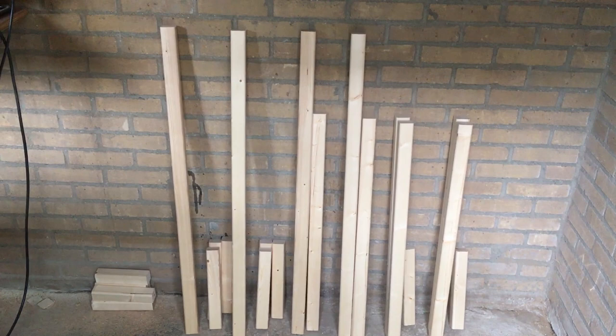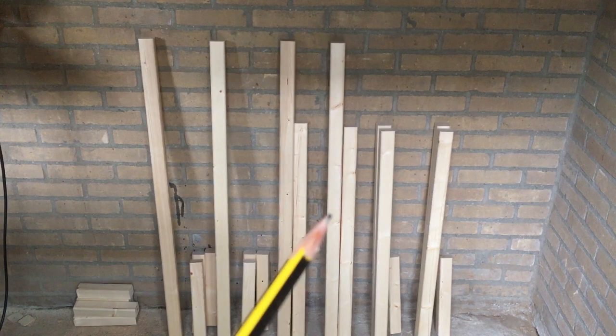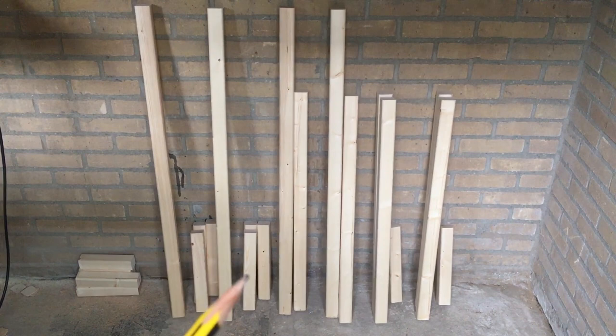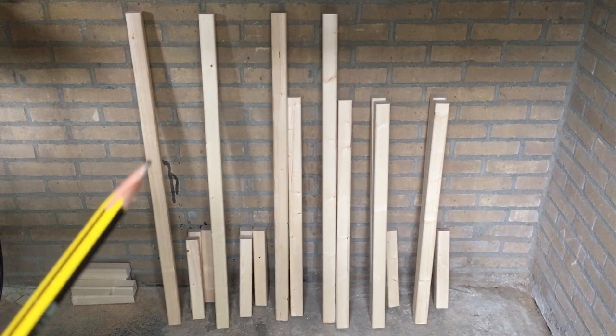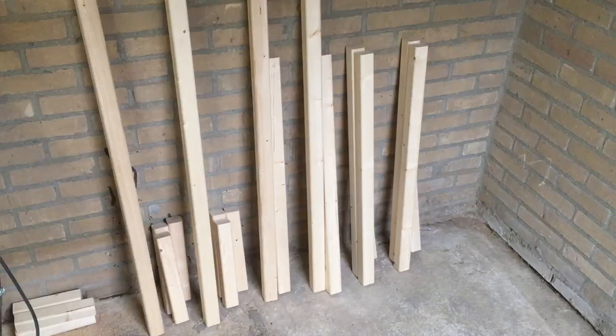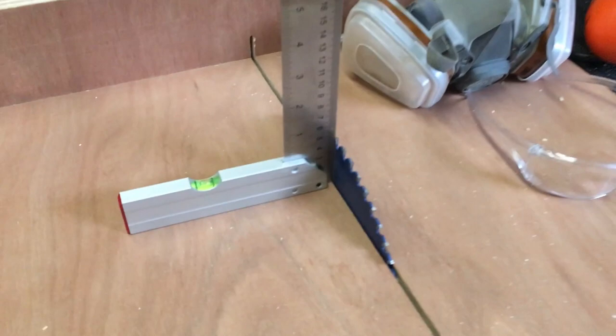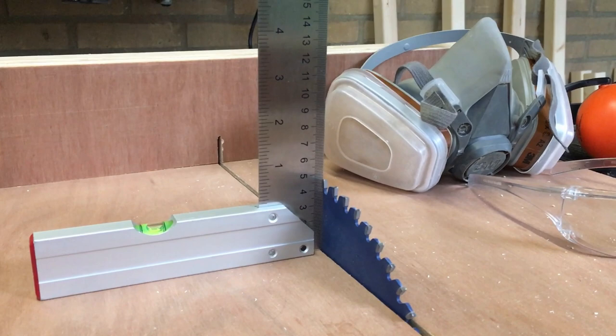All the wood is cut to size. From left to right: the remainings, then four big pieces for the main vertical beams, and several small crosspieces connecting the two beams on the sides. One, two, three, four, five, six pieces will go in front of and behind the wood panels. Now it's time to make all the pockets. The height defined in the drawings is 21.5 millimeters — I'll test this first on a piece of scrap wood.